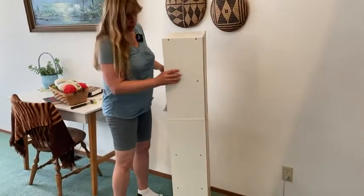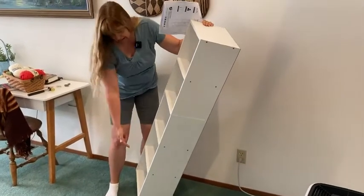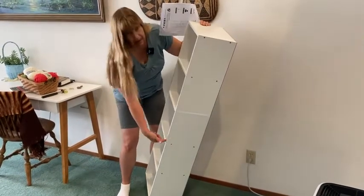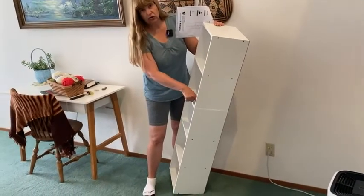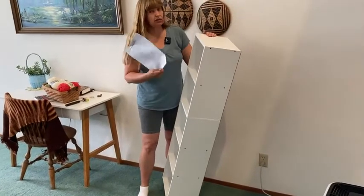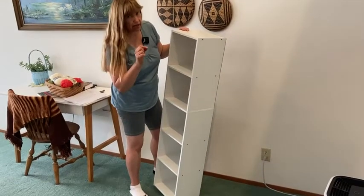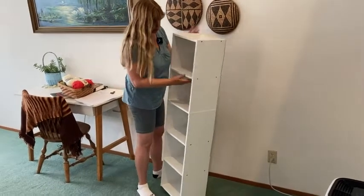Wait until you have them all lined up. Because if you screw one in tightly when you have the three shelves, you won't be able to tell whether you're lined up on the other two. If you get it screwed in incorrectly, the screw can come through the shelf and create a hole or a bubble in your wood. So if you're having difficulty with that last side, set your screws, barely tighten them, and then once they're all in there, tighten them all up and they'll be lined up correctly.